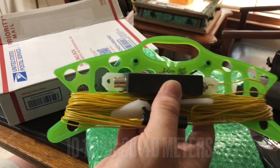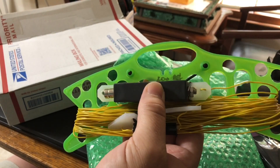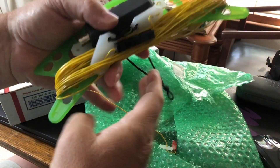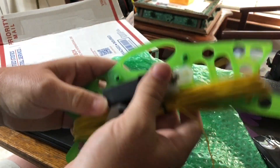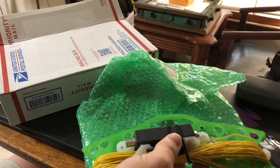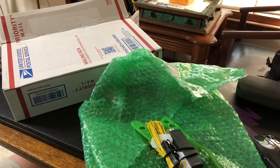These are priced under $100. 10, 15, 20, 30, and 40 meters, just as you see it. It's lightweight — the transformer doesn't have to be as heavy since it's only handling 15 watts. I'd recommend staying at 15 watts or less to be safe. The nice wire winder secures it and it's ready to put in the backpack. I carry mine in a small bag. The transformer is super efficient on the low bands — close to 97% — so almost all the power is converted to RF. I ran it on my MTR-4B and the SWR was quite good.